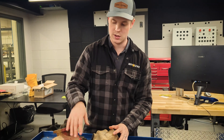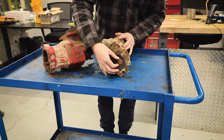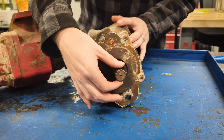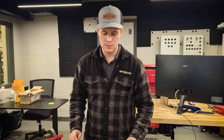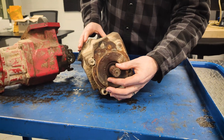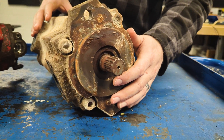These shafts on these two have obviously failed at some point due to a lack of grease on the splines. This one's very dry. This one doesn't have a lot of damage on it, but it did do some major damage to the PTO output shaft. These mating surfaces on the spline shafts where there is no grease can cause a lot of damage if they're not greased periodically as per the manufacturer.